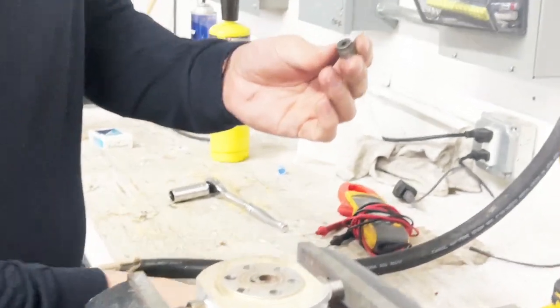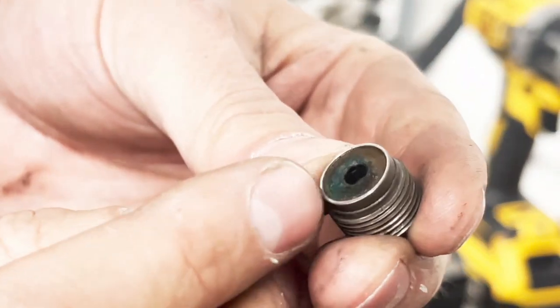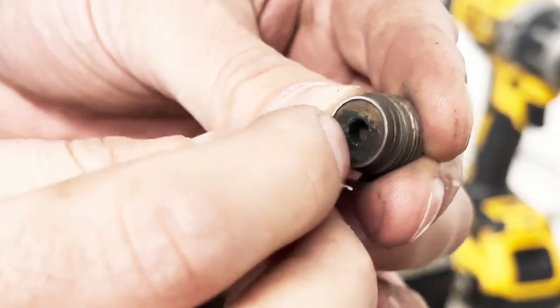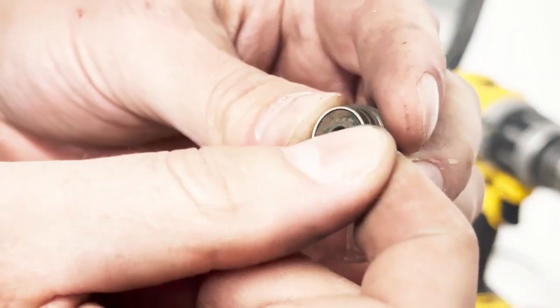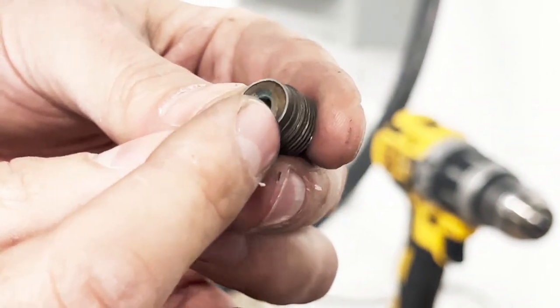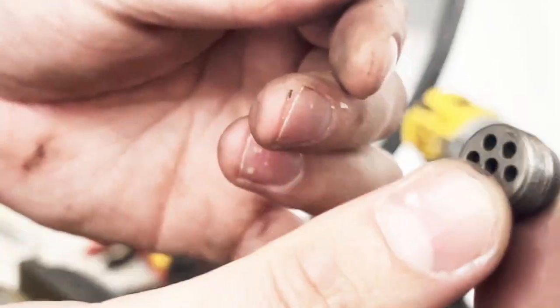Here's the valve, and this one has a valve plate. You can clean this valve using gasoline or something similar. Push the valve plate in with a sharp thin object to see if the valve plate is working properly. There's a spring inside — if the spring is broken the valve is not going to work properly and needs to be replaced.